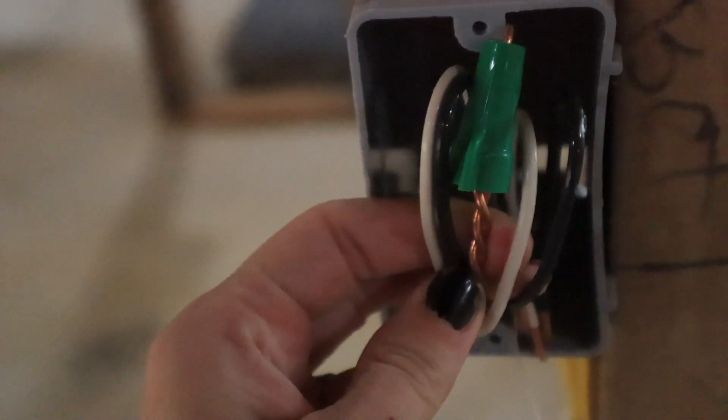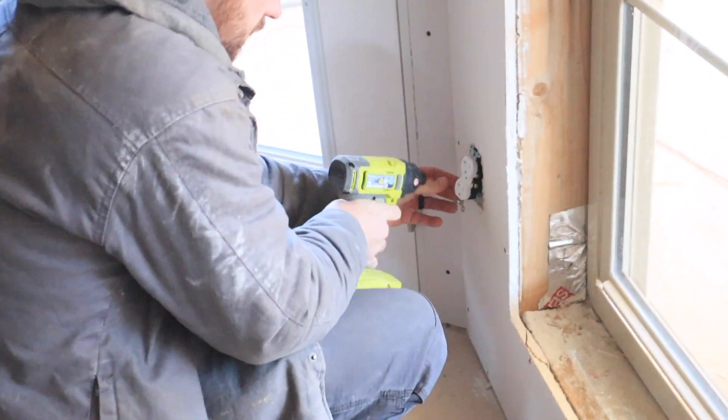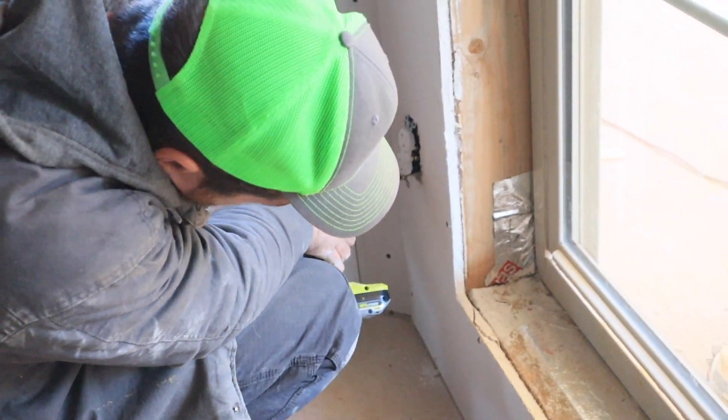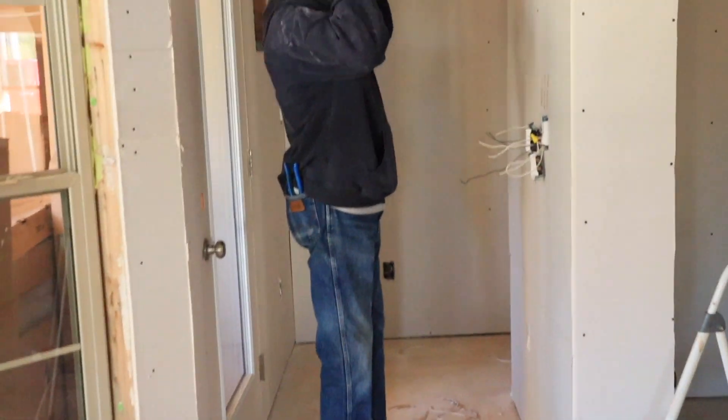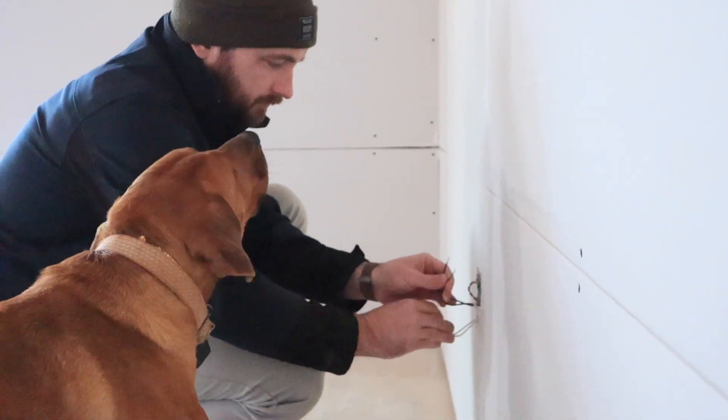He has to be able to see the wires. Once we got the A-OK on the rough-in inspection, we proceeded to put sheetrock up and then go ahead and install outlets, switches, cover plates, lights, fixtures, things like that, in preparation for the final inspection.